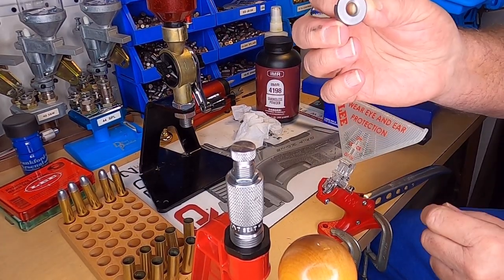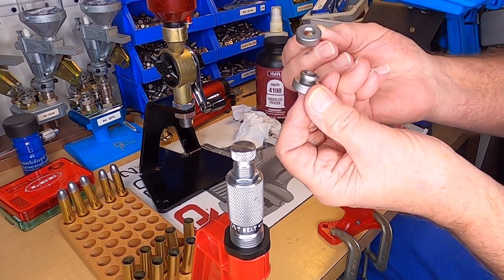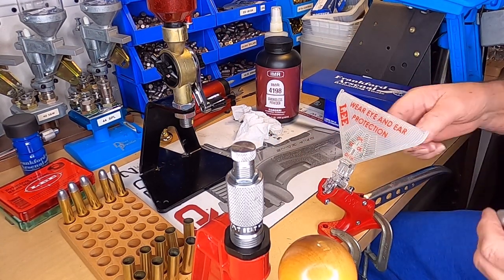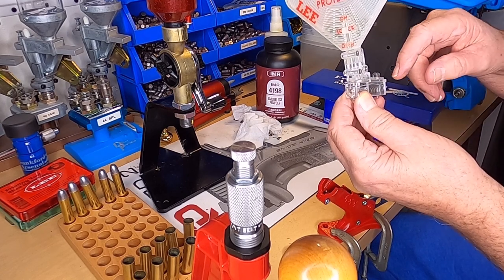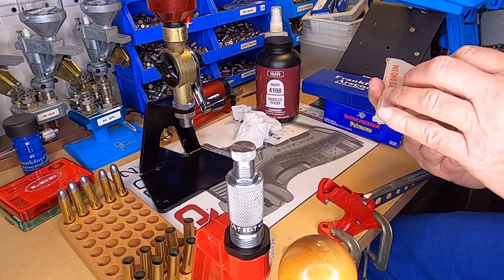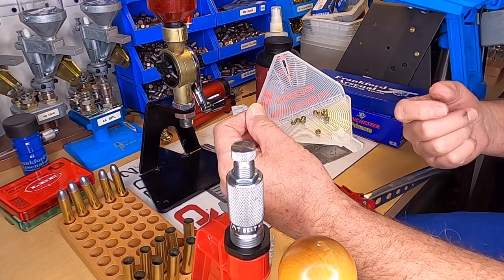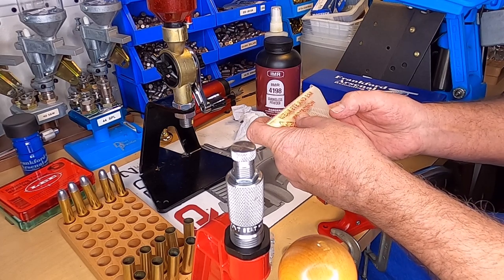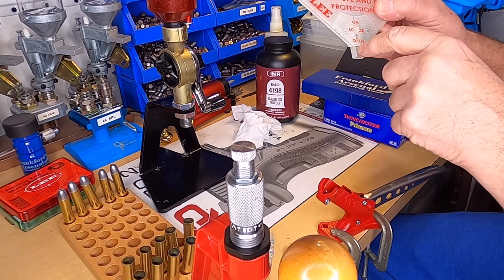These are different though — they don't have a shoulder on the bottom. For your single stage press it's got a hub on the bottom; this one's smooth. This one's got a large and small primer base, and these are separate — they come out and open up to hold your primers. When you put your primers in there, make sure the primers are facing up — the open end will be up. Your thing here says 'lock' — make sure it stays locked, because if you put it to open they'll come out the bottom.